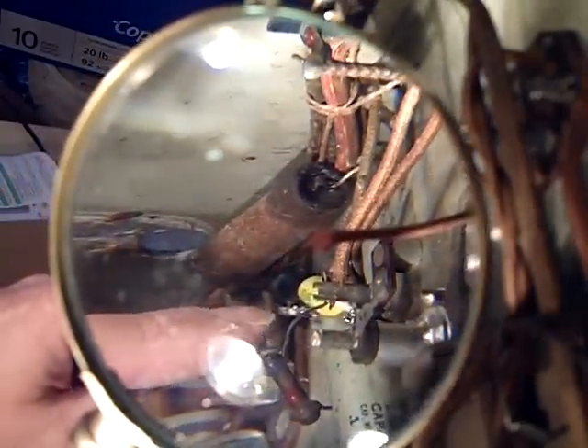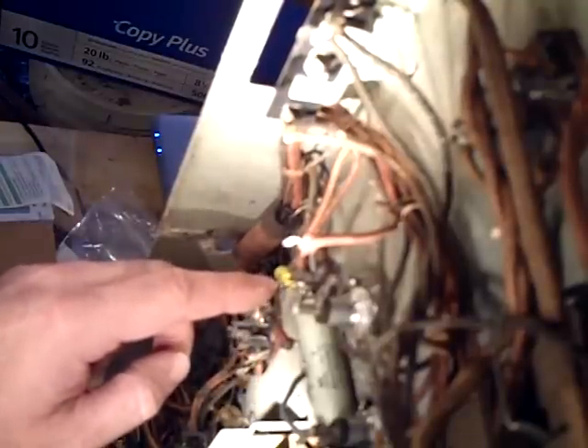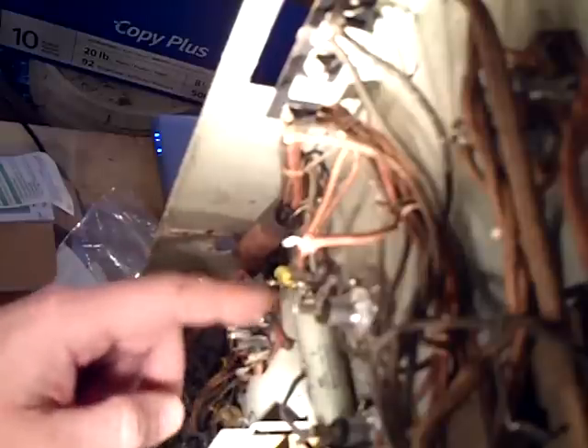That should be okay. I've got seven minutes here. What I do now is inspect it with my magnifier because my vision is not too good — I inspect it with a magnifying glass. The heat shrink partly shrunk, so what I'm going to do is use the heat gun. You really don't want to try to melt the rest of the heat shrink with the iron — it'll make it lousy. A heat gun will shrink the rest of the heat shrink and make it look nice. So that's how you replace a capacitor. I hope this video came out okay — take it easy, bye.